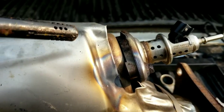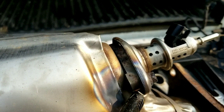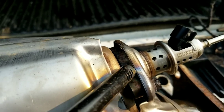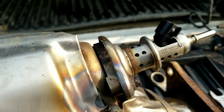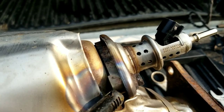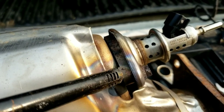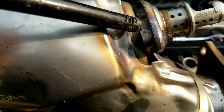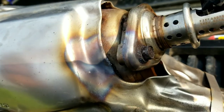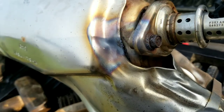What I did is I put heat on this flange and got it to glow red pretty quickly using propane and oxygen in my cutting torch. The first step I'm going to try is let it cool. I want to get it hot and let it cool, because I believe if you have it cherry hot and try to remove it - while that may work in some cases - you run the risk of galling, especially with stainless steel like we have here. It looks like a carbon steel bolt, and I may look for a stainless bolt to put in there.